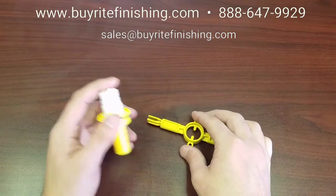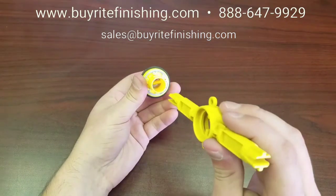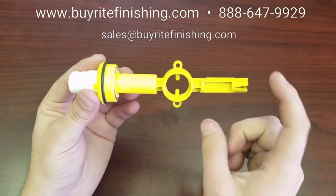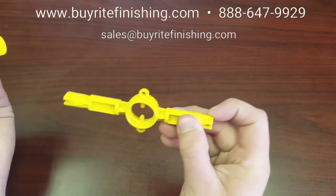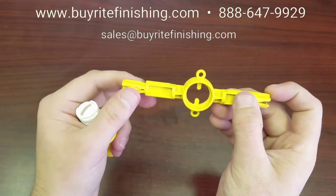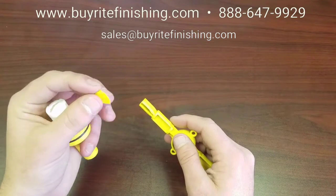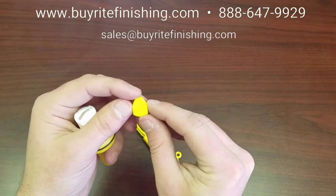To remove the wedge, take the deep slot and slide it over the wedge until you hear and feel a slight click. Once you feel that click, softly push down on the tool to provide a little more pressure and pull straight out. Be sure not to push down too hard as you could bend the wedge or wedge mount. Remove the wedge from the tool and check it for inconsistent wear. If the end of the wedge has lost its point or is wearing inconsistently, you should consider swapping it out for a new one.